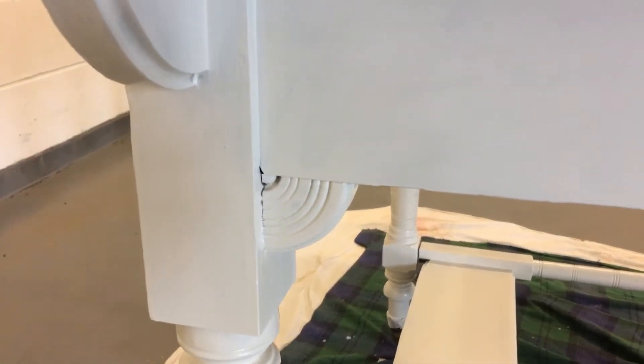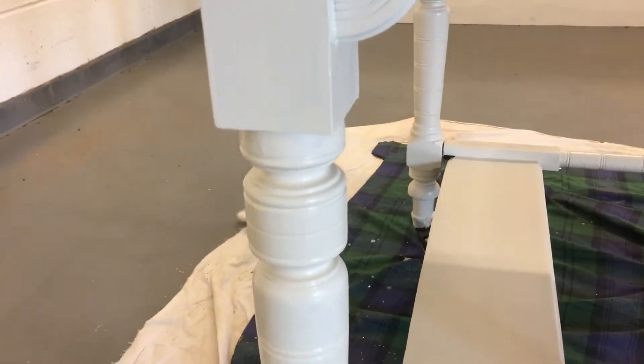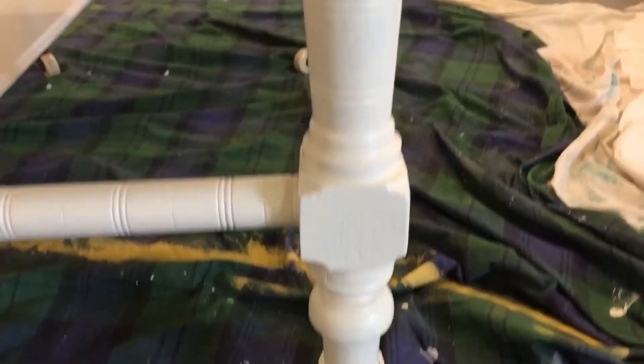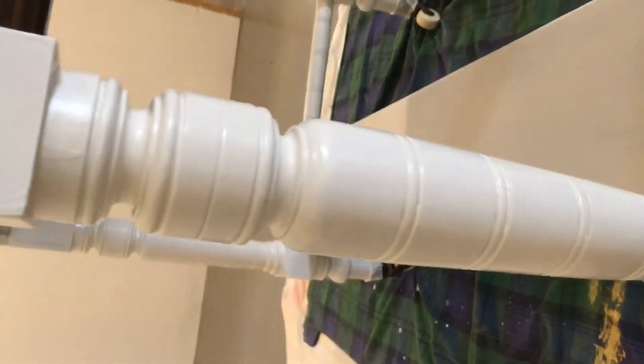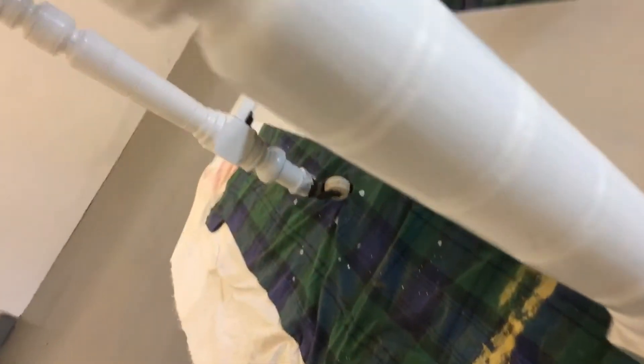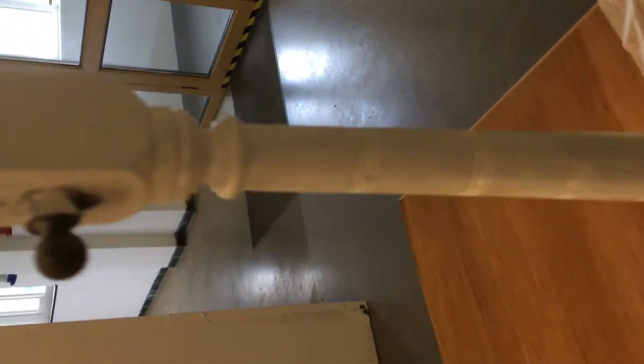It's had to have a primer because it's got so much tannin in the wood, and some stains and things like that — and it's so old it was stinking dirty. I think I cleaned it three times and rinsed it out three times. Look at those legs, really, really nice. Unfortunately I had to use a shellac primer which isn't water-based, it is oil-based, because I normally try to use ecological products wherever I can. But unfortunately on this occasion this had to be done, otherwise it's going to bleed through the paint and my lovely final colour will just turn into brown gunkiness — such professional terms there.